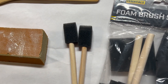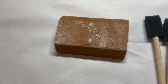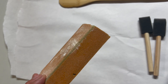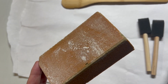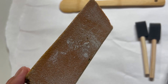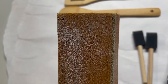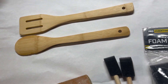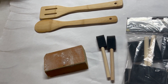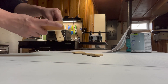I will link some foam brushes in the description. I love that this set had these skinny little brushes because they'll be perfect for these handles. You'll also need some sandpaper or a sander — I'm just going to be using this sponge with sandpaper on it. It has different sandpaper grits: one is really soft and one is really rough. I'm just going to pick a side and sand these really well, because I learned my lesson on the tray — you need to sand it super well before you paint it. I'm going to try to go against the grain this time.